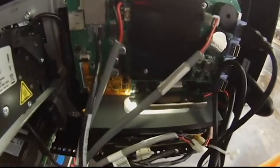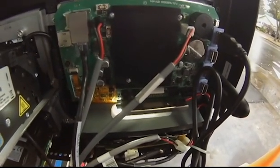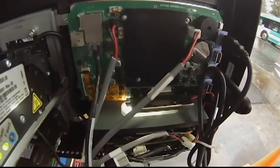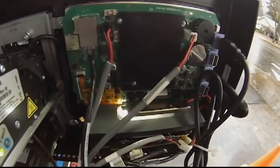It will not give you any kind of indicator to let you know that it's done loading. So just give it 20 minutes. At the end of 20 minutes, you're safe to remove the USB and reboot, at which point you're ready to load the actual iXpay software that'll bring you up to your normal operation mode.